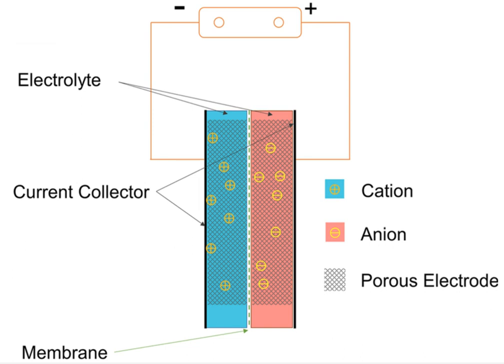Activated carbon fibers. Activated carbon fibers (ACF) are produced from activated carbon and have a typical diameter of 10 micrometers. They can have micropores with a very narrow pore size distribution that can be readily controlled. The surface area of ACF woven into a textile is about 2,500 square meters per gram. Advantages of ACF electrodes include low electrical resistance along the fiber axis and good contact to the collector. As for activated carbon, ACF electrodes exhibit predominantly double-layer capacitance with a small amount of pseudocapacitance due to their micropores.